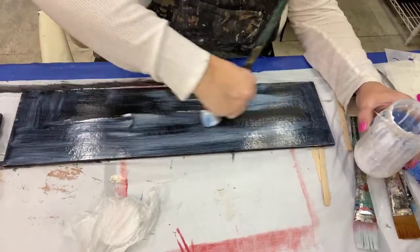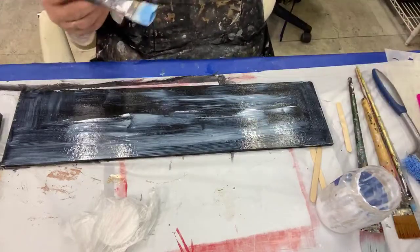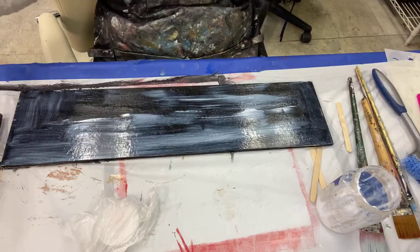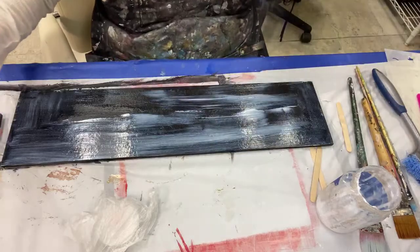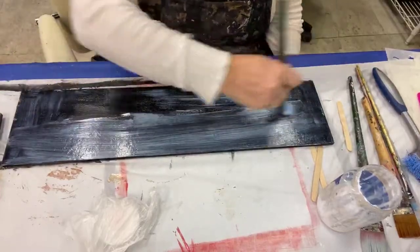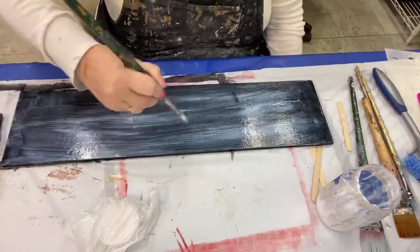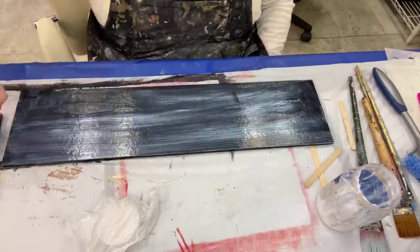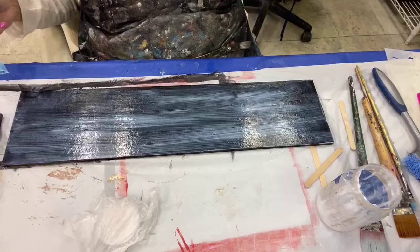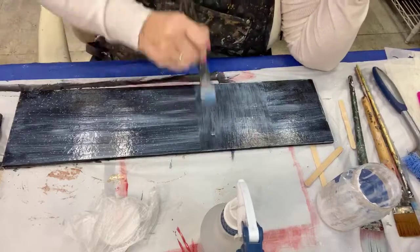Now, as this is kind of thick, and I'm not really loving the way it's going, I'm gonna use a water spray mister. I'm gonna test my mist to the side, and then I'm going to spritz lightly on the surface just once, and that just dampened it enough for me to be able to move it around a little bit. It's almost like I created a slip coat with the water that allows this product to slip around a little easier. I'm going to spray right there. I got more than enough adhesive on here. I just have to move it to where it's too thin.